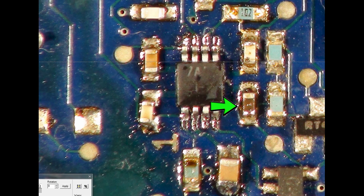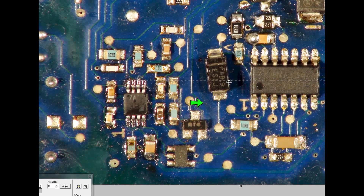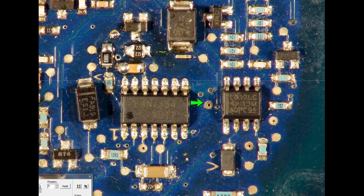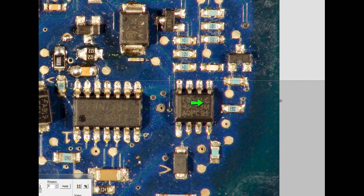Around here is an ordinary switching diode that can get blown up - I've seen that. And this transistor up here - I keep a tick chart of things I've blown up and changed just to see what's been problematic, it really does save time. It's a PNP, just a standard general-purpose 40 volt PNP transistor.